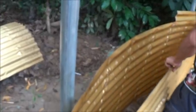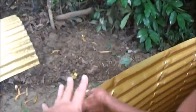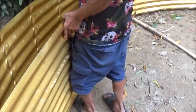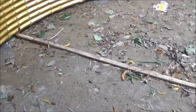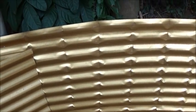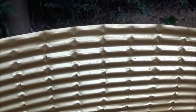So this is the curve that we're trying to get. The span of my hand is 10 inches, so we're trying to get a foot out of it. There's just no way to get this to bend a foot without kinking. The reason Tatai and crew were making these little dimples every 6 or 8 inches or so is so that they would be little dimples and not big giant kinks, so that it would completely fail.